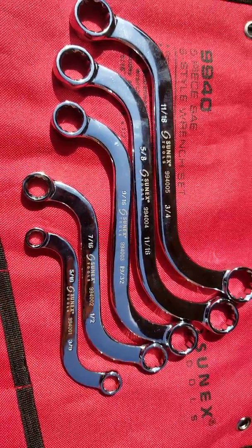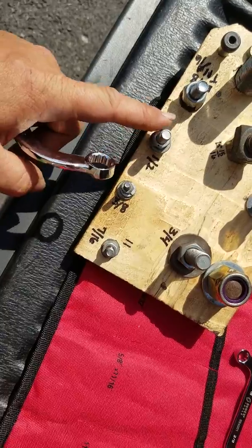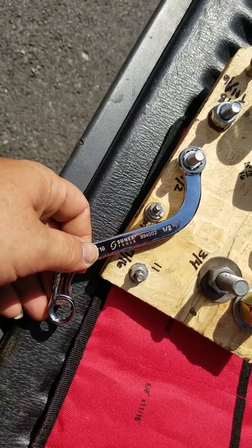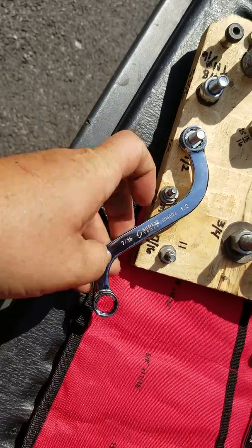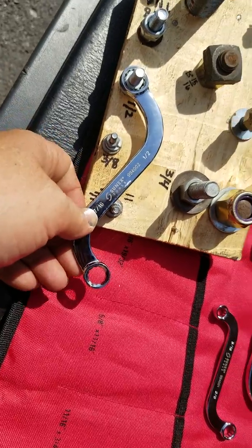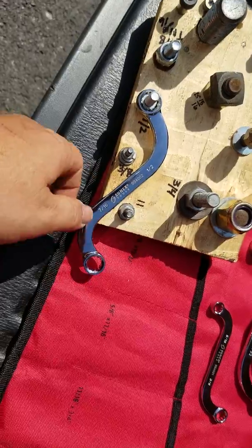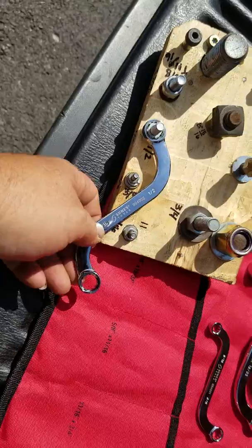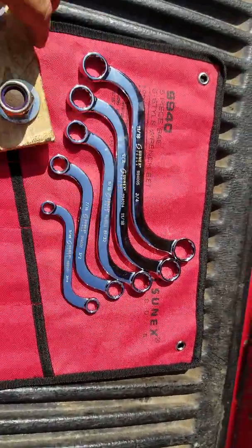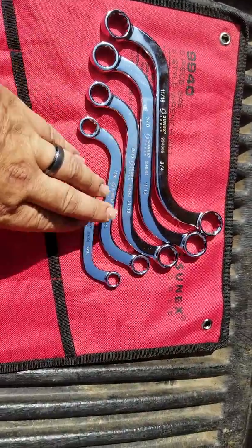Let's see how these hold up. Using a wooden block as an example — here's a half-inch fastener that you can't reach with a standard wrench. This is what these S-style wrenches are designed for. The half-moon shape is also good for getting into tight places, but the S-style lets you get inside and work however you need to turn a fastener. It's really useful for anyone who works on anything serious, especially industrial equipment, which is exactly what I'm putting this set toward — there's a toolbox at a plant where I work.